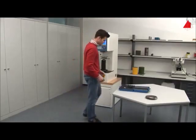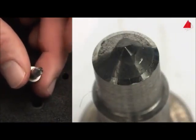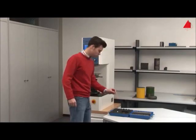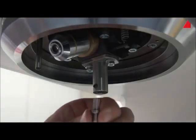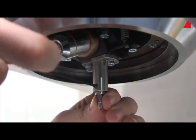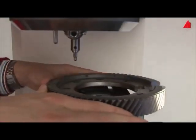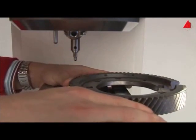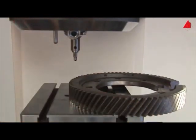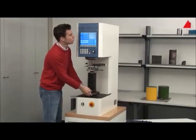This is how the test is carried out in practice. The tester selects the conical diamond indenter and installs it in the testing machine. Then he picks up the gear wheel and puts it on the support table. After rotating the microscope lens to its vertical position, he can adjust his test piece. As soon as a focused image can be seen on the screen, the surface of the test piece is in the correct height.